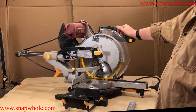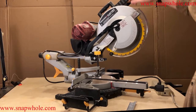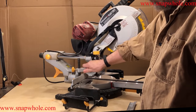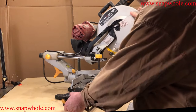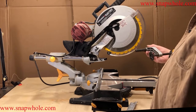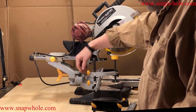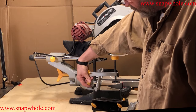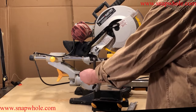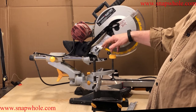You have to have enough room to slide it all the way back to cut and slide all the way forward to position your wood. This is a hold-down for the piece you're working on — you adjust it and it goes up and down. You can actually take it off and put it on the other side, although on the other side it really just gets in the way. So put it in place, lock down the spindle, position this where you want it, and tighten it. Half the time I don't use this, although I do recommend that you do.